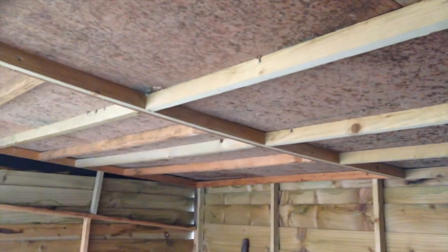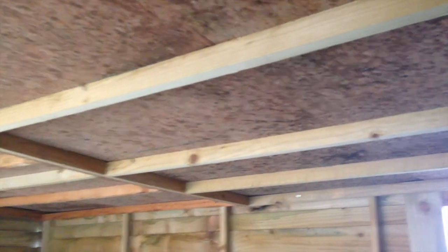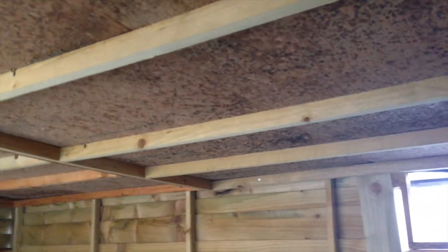So when you look at it from the upstairs window, you look down onto the roof, it does sag a little bit. And when it's drizzly rain or been raining a lot, it does tend to get stuck on the roof, so it gets a bit damp up there. It's only leaked in 1 or 2 spots. That's not been the major problem with moisture coming through, but obviously without it being insulated, and like here for example, behind here, pull that out of the way, we've got daylight all the way down there. This is because this is sort of 2 sheds stuck together, and there's a big gap down there. So we've had a bit of an issue in here with moisture and it not being insulated.